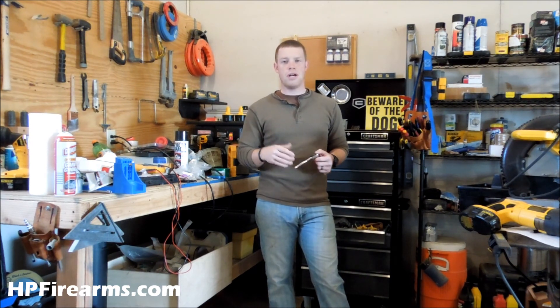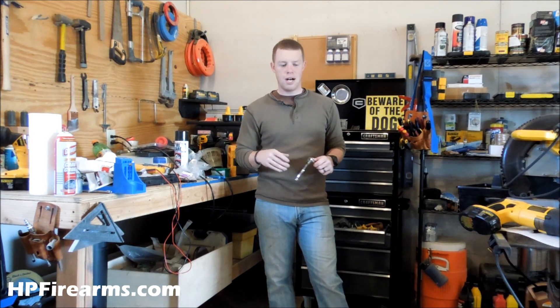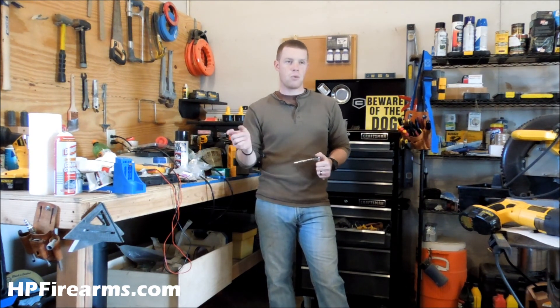Before I show you, I want to talk a little bit about the motor that we're using. The motor — and I've talked about this in other videos — is actually an old recycled treadmill motor. It's a permanent magnet DC motor. And when it's spun, it'll produce electricity just like it takes electricity to make it run. It'll work backwards in reverse polarity.